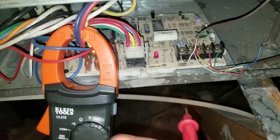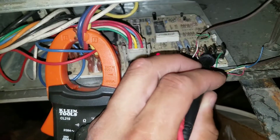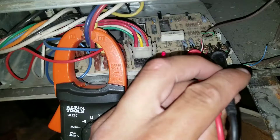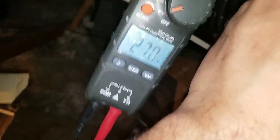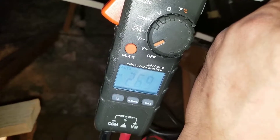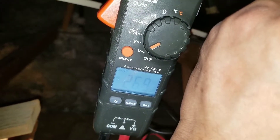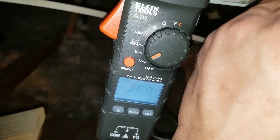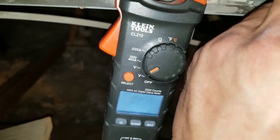I have my common, and what I'm going to do is take my common and tap my red wire — my R terminal — on the furnace board. That should give me a reading of 24 volts. You can see here I'm at 26.9. You should get a reading anywhere between 24 and 28 volts. So right now, according to my board, I am getting 24 volts down to my thermostat.